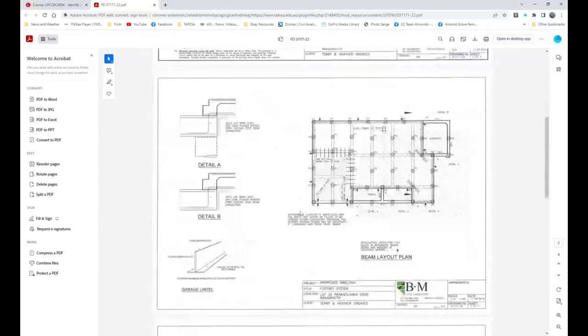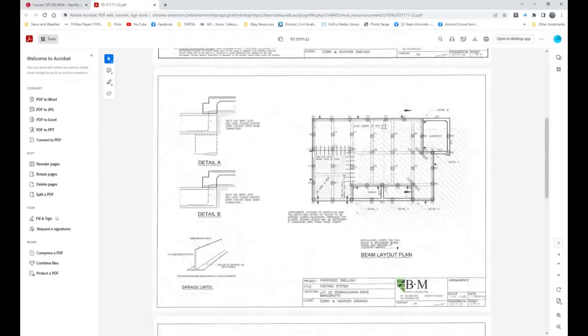Now, the next part is generally what you get: just a basic plan view of where the strip footings go. It will tell you that it's SF1 and SF2, and this over here is SF2. There is one very good reason for that. This long run through here, which is 7240 between brickwork to brickwork, plus 600, so 7840, is the length of the SF2 through here.